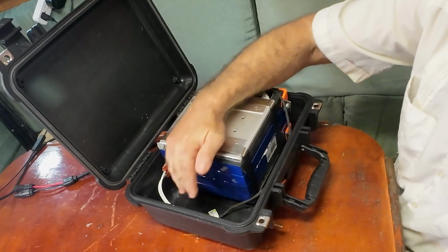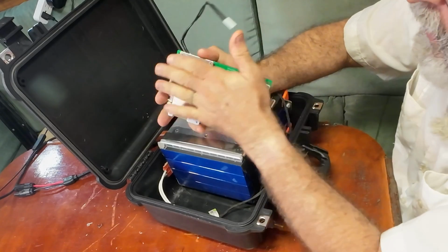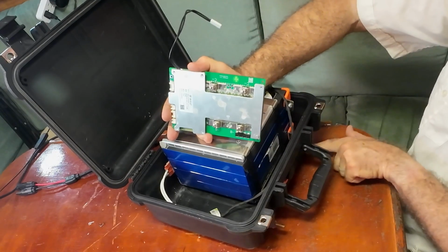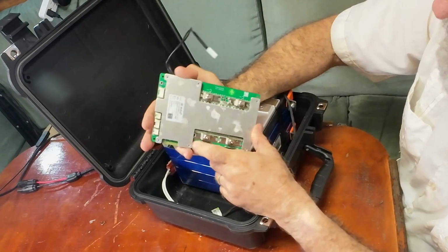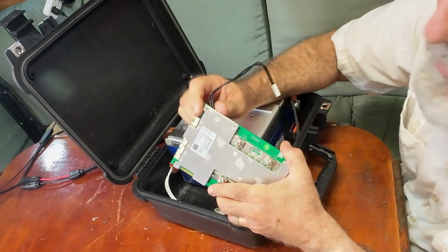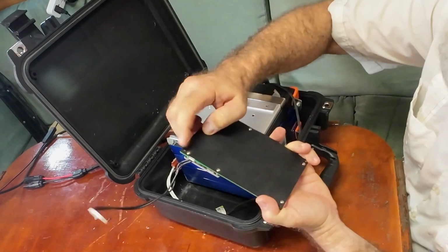Unless I put an insulator in, there will be exposure to all these terminals, but all of these terminals are negative. There's no positive anywhere near with the setup. The positive's way over here and the positive pole's way over here. So it's quite safe. There's an exception. This technically is positive, but the way I'm going to solder it, it's just going to be not reachable. I'll have insulation right down and I'll solder from the back.